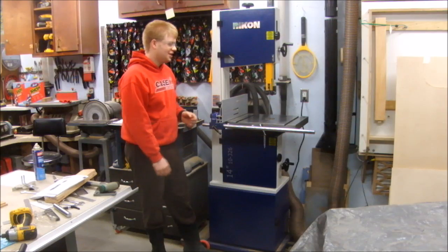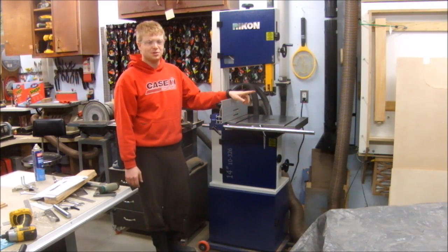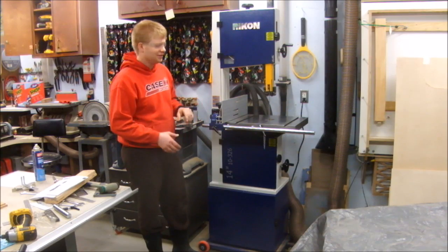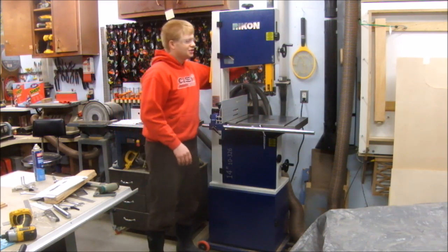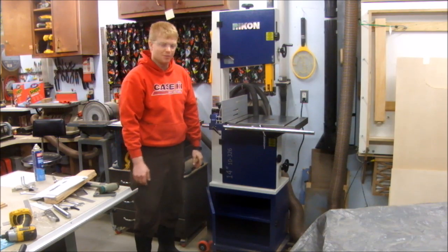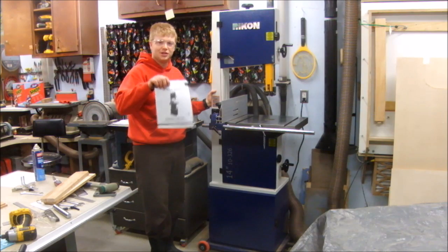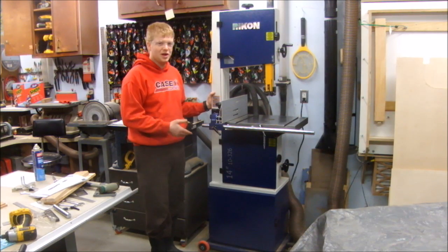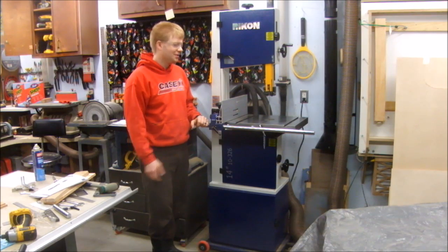Let me give my brief conclusions on the saw. Overall, I did a lot of research before buying it and I still maintain it's one of the best bandsaws on the market. The ball bearing guides are far superior to the friction type that wear out, and the fact that they're tool-less is pretty neat. The fence, despite some nuances, is also one of its best features — with this large capacity fence you can put it on either side of the blade. I do wish the tension lever was more visible. Also, the storage door opening up and hitting the wheels on the wheel kit is a problem Rikon should fix. I did have to adjust the wheels to be coplanar, but the manual had pretty clear instructions. Overall it feels like a quality machine, and I'm excited to have it in my workshop.